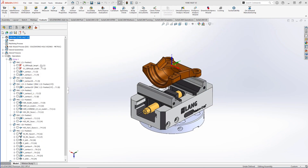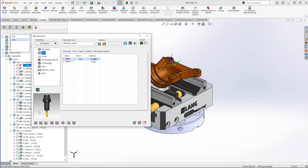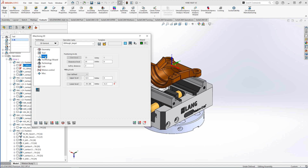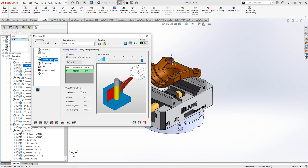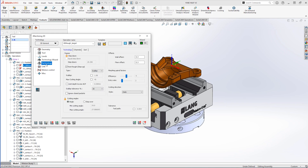To start our machining off we're going to use 3D iMachining, and you can see I've already got this programmed up. The 3D iMachining is great for getting a 3D roughed shape out of the billet material. You pick a tool, get its starting position if need be, pick an upper and lower level to machine to, and then the iMachining wizard allows you to set feeds, speeds, and step-down — all within parameters that will be safe for operation and give maximum material removal.